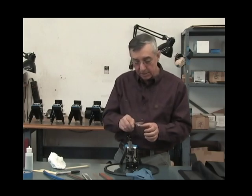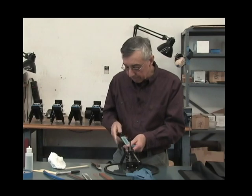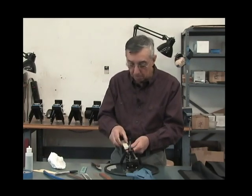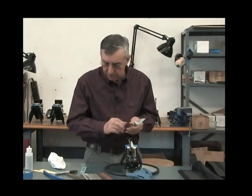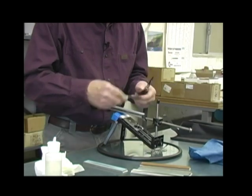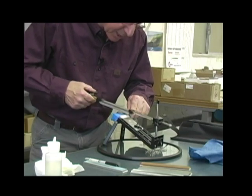You'll see that the edge of this knife is not quite smooth yet, but it's getting smoother. By the time I get it all the way up to the 3000, it'll be perfectly smooth. Now, especially when you're polishing a tactical knife like this, there's one other little trick you might do. Put just a little bit of marker on the blade and make sure that your polish tape is cutting. And you see, that's why that edge wasn't smooth.